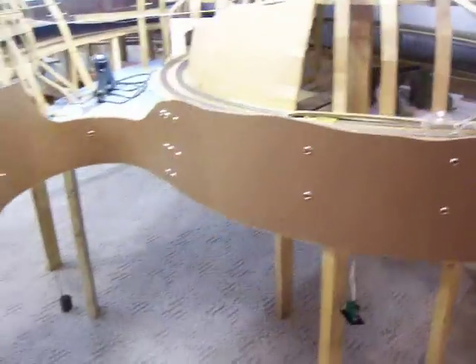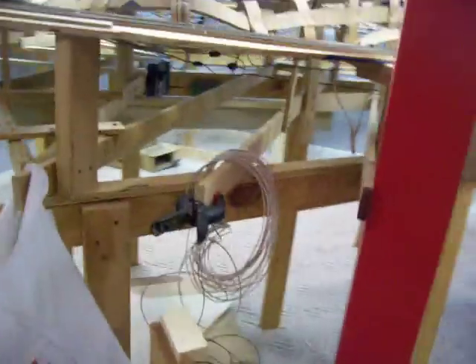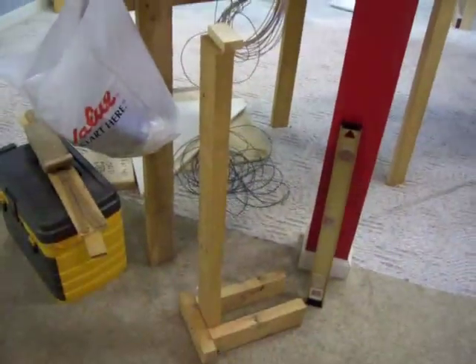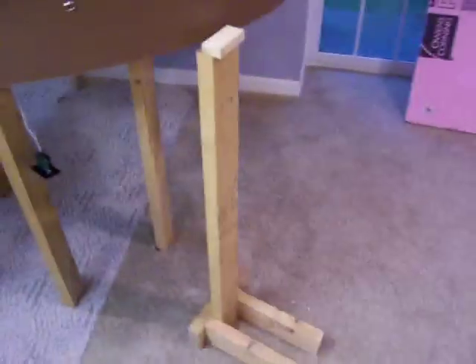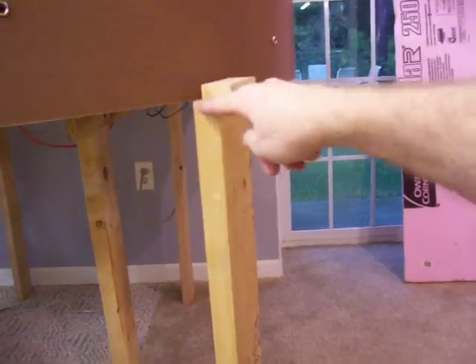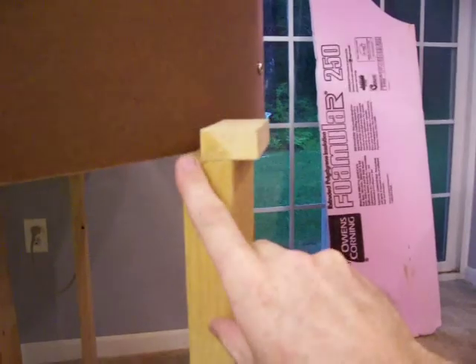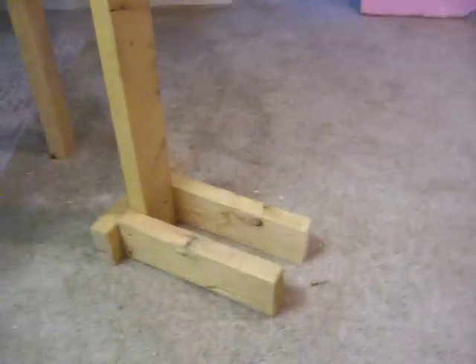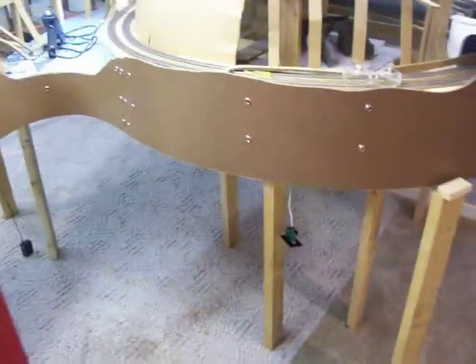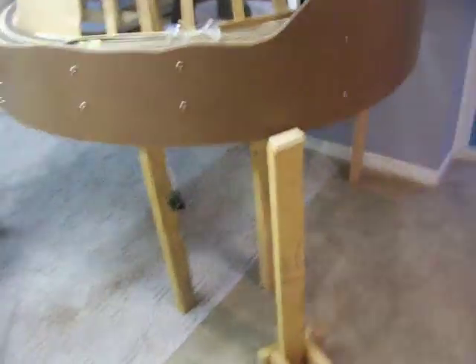It's looking good. To help maintain the height of the bottom so it's consistent — I'm by myself pretty much — I made this jig here. It's three feet tall, pretty much six inches to this point, which I decided is the bottom of the fascia. I just rested it on there. I made these feet so I could kind of wedge it because of these tight curves. It was almost like an extra hand or two — I'd shove it underneath, kick it under with my foot, hold the rest of it with my hip and start screwing in.